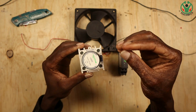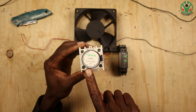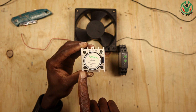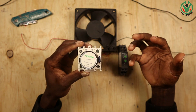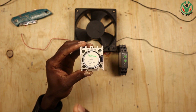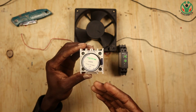The moment you apply force here — because it's an on-delay timer — it will start counting the time you've set. Once that time elapses, it will close the normally open contact and open the normally closed contact. In a star-delta starter, the circuit starts with the star closed, and after the set period of time the star is de-energized and the delta energizes.